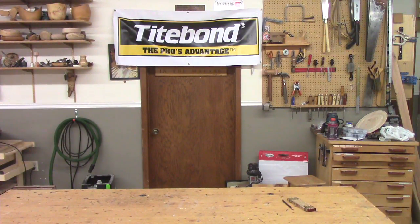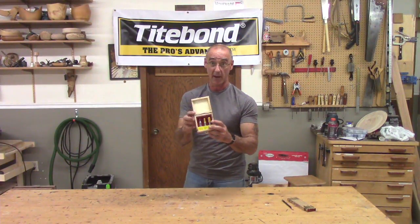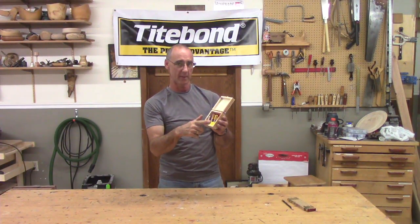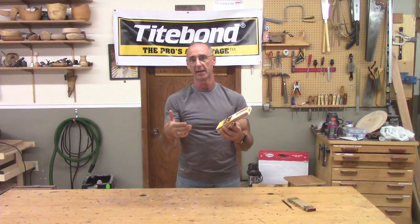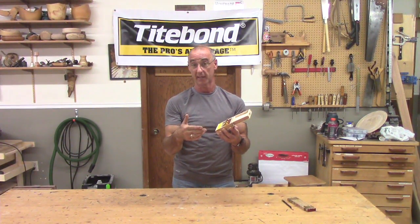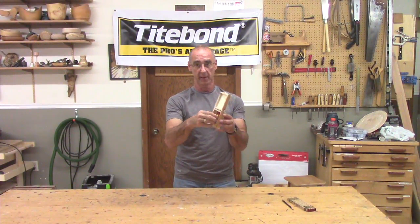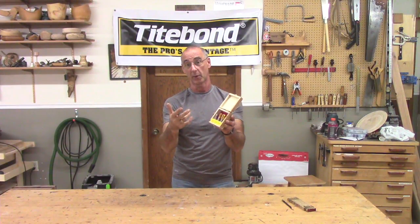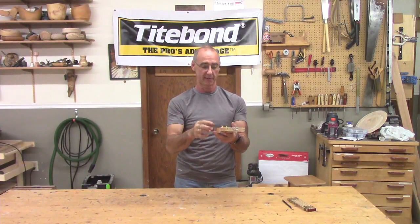If you're not familiar with this, what John's talking about are plywood-specific router bits. So this is a set of them. The theory with plywood router bits is that plywood with 3/4 inch stock tends to run a 32nd of an inch undersize. So instead of 3/4 of an inch, it's 23/32. The largest of the cutters is not a 3/4 inch bit, it's a 23/32. So the theory is, one pass with that and my plywood will fit.